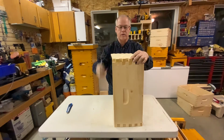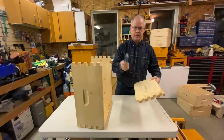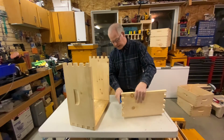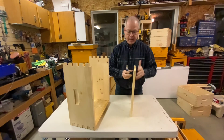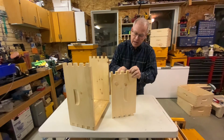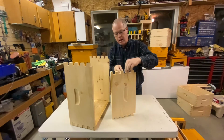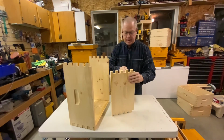Don't need any saws, don't need any fancy equipment. I do it just with an X-Acto knife. So basically once you have those marked, all I'm going to do is I'm going to go on the inside, I'm going to make a cut on the both of them, and then I'm going to put the knife on here and I'm going to take off just a tiny, tiny bit. And because it goes with the grain of the wood, you see how that pops right off? The chip will come right out, and now all of a sudden it's easy to make the fits.